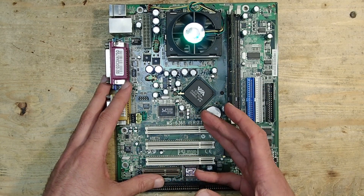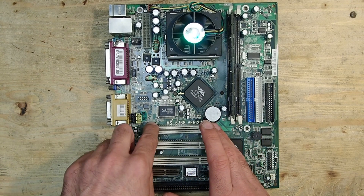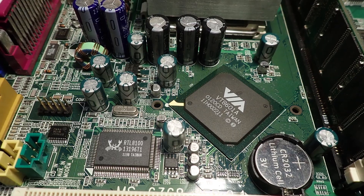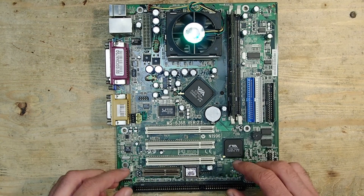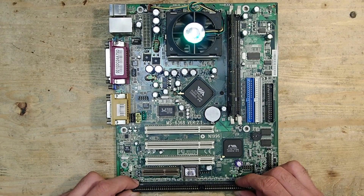The front side bus and the CPU could be throttled down to get to the speed of a 486 machine and play games which wouldn't run at full speed otherwise. The board also has an integrated DOS-compatible Realtek network adapter. The Trident VGA has good compatibility with DOS games, and the board has an ISA slot on board which could be used for a dedicated sound card.